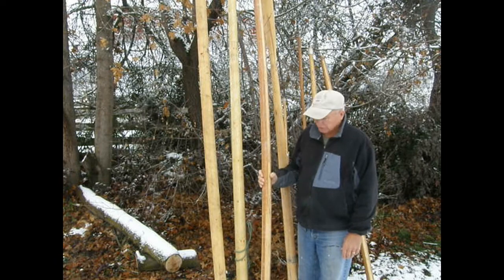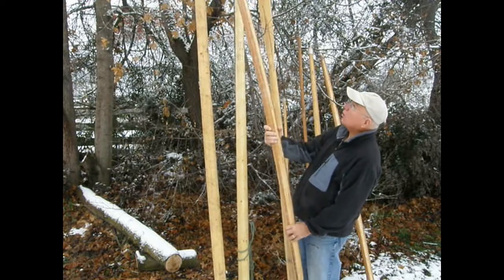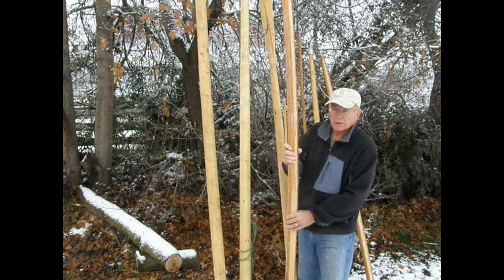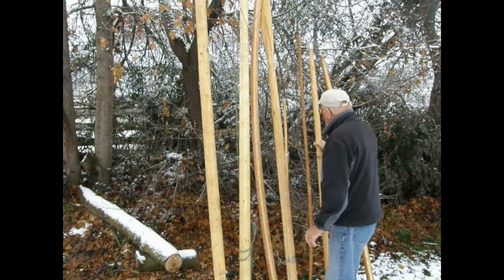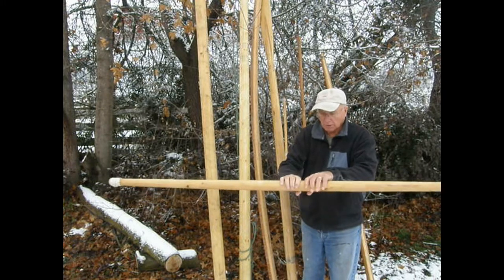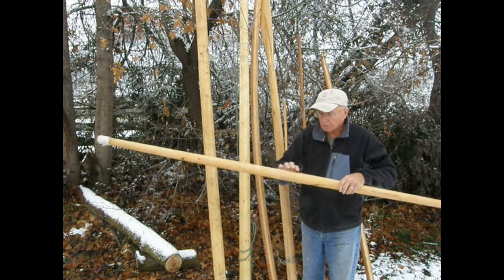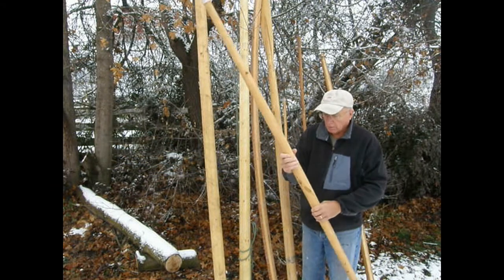We can put multiple layers of fiberglass in that area and strengthen it. Sheathing also increases the stiffness. I could make this yard for a lateen sail curved and light, but I didn't want it to be that flexible, so I could sheathe it and have the best of both worlds. Sometimes, like on this yard where the bending stress is located where it comes up against the mast, we can taper the diameter so it's thicker where stresses are greatest and also reinforce that area with fiberglass sheathing.